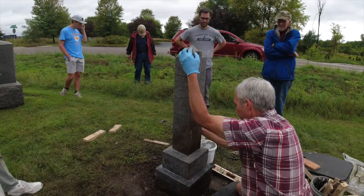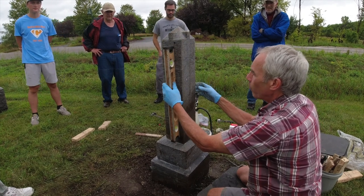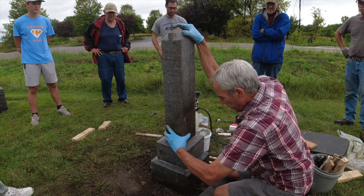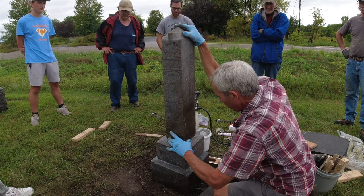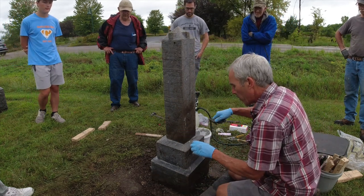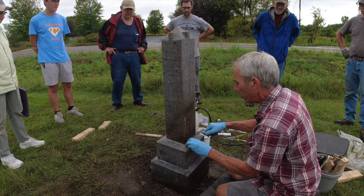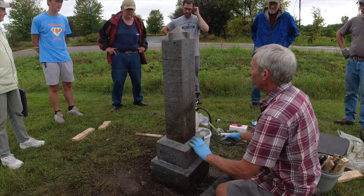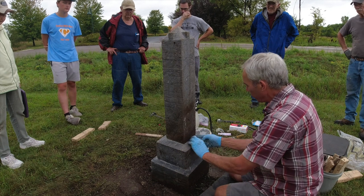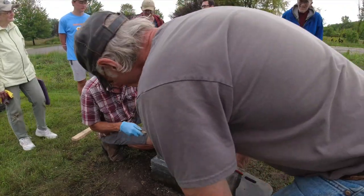Get it to seat itself a little more. Historic stones — the milling and everything varies a little so they're not always perfectly square. That's much better; it's within the bubble — that's perfect on that side. It's actually not cut perfectly symmetrical. It's such a light stone that I have to help it go down because the putty is thick enough to be opposing it; with a heavier monument you won't get that effect. How long will it last? This will last indefinitely — pretty much forever unless someone hits it. It's a double bond: the seal on the outside protects the epoxy putty internally, and that seal will slowly harden it while the inside stays pliable for a long time.